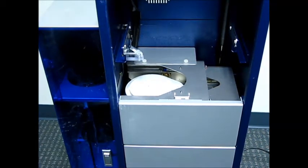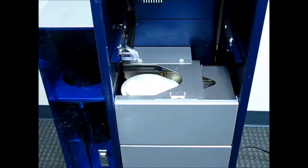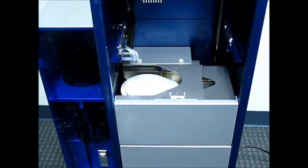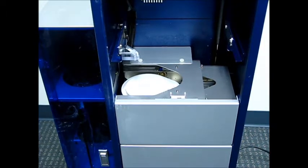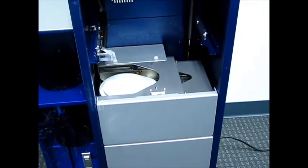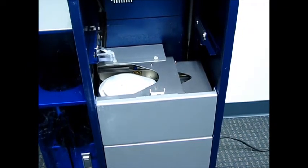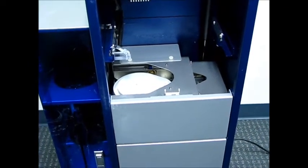Then underneath that, your under splash cover is held on by 3 of the same screw. You remove those screws, then you can remove that undersplash cover. Now, if you take a look at the drain hole on the right-hand side of that undersplash cover, you're going to see that there is a funnel that's located below there, and then you'll remove that funnel.